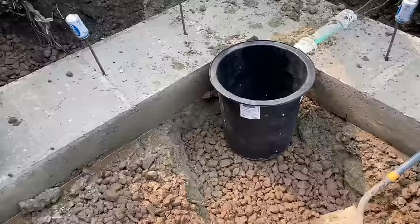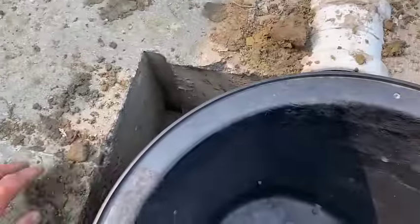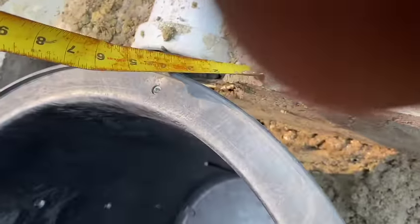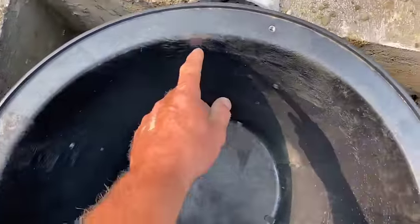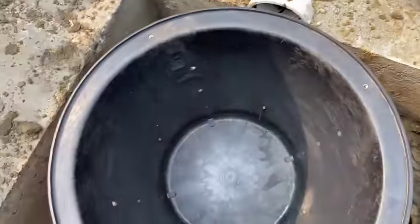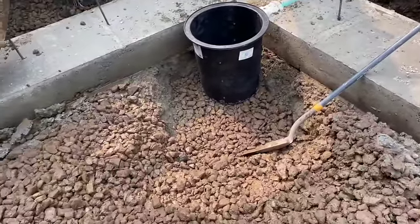Here is our sump crock, guys. I set it 3.5 inches off the footer to the top so that it's a little bit lower than the floor. We stuck that pipe through the footer yesterday, so it sits at about 3.5 there. Our floor is 4 inches, so that'll keep it just down below the surface. And I gotta cut a hole here and stick a piece of pipe through there into this coupler. Stick this coupler there. And then it's got them holes I drilled in it all the way. Got what, 3, 6, 9, 12 holes in it. Let the water in. We oversized the hole here quite a bit. As you can see, got a big hole there. It's all gonna be filled with stone, so any water that gets in here on the inside, it's gonna run right into the crock.